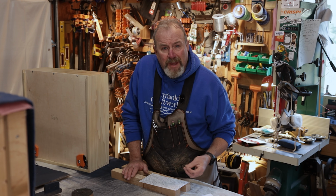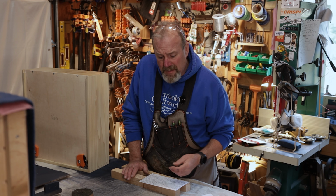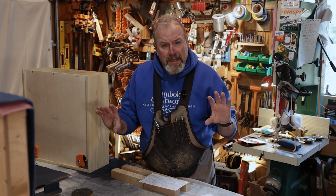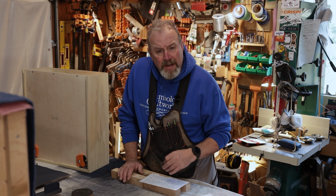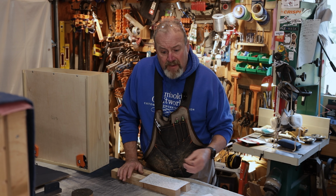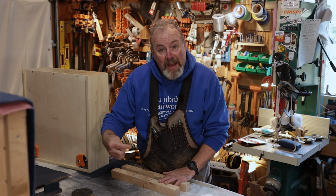A few mistakes people make when they're building toe kicks for cabinets or furniture, doesn't matter, is they actually attach the toe kick to the base and expect everything to work out. And it doesn't work out that way. So the first thing I'm telling you is leave your toe kicks loose, because you never know what's going to happen. You might have electrical that has to go through there.